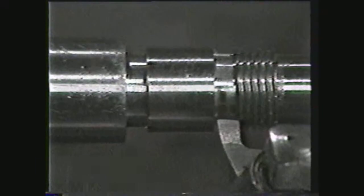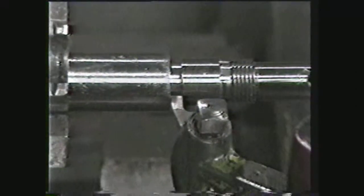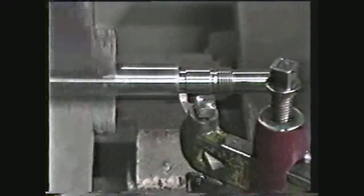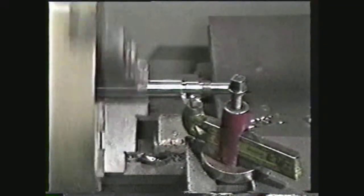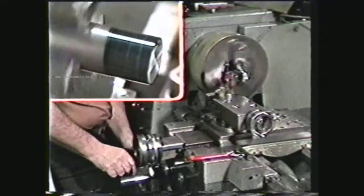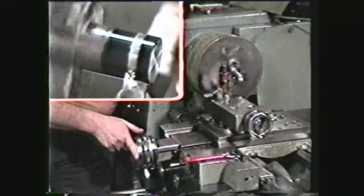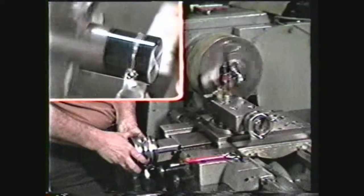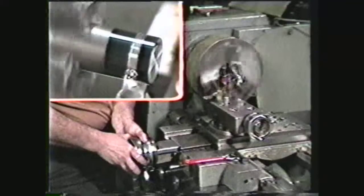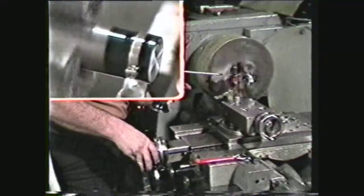Parting or cut off tools may also be used for necking and grooving. Since the shape below the surface will follow the shape of the tool, parting tools will cut a square groove or recess. To use a parting tool for necking or grooving, set up the tool and the machine as you would for parting. With the workpiece blued, lay off the mark where the groove is to be cut. Using the carriage and cross-feed, touch the tool to the work with the edge of the tool at the line. Set the cross-feed dial to zero. This groove will be one hundred thousandths deep, so apply oil to the tool and feed it by hand a distance of one hundred thousandths.